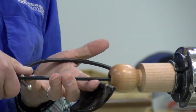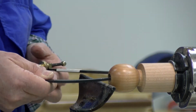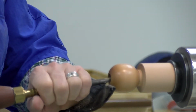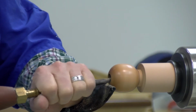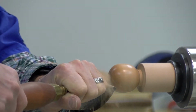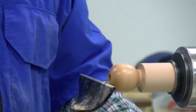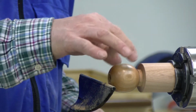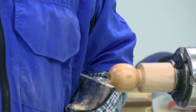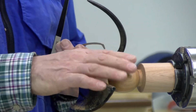We'll see. This one's in the center. It's still a little bit close. Okay, I got ways to go. So yeah, do it one more time. I'm going to call that pretty much good. It's a little more hollow, but the technique, you just work on it until you're comfortable with the thickness. If it's not thin enough, just keep working on it slowly. The thing is, check it very often as you get to the point where it's at right now.